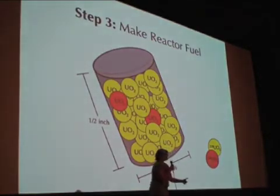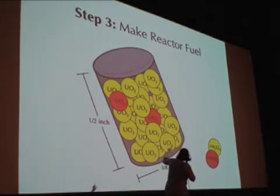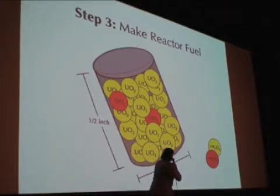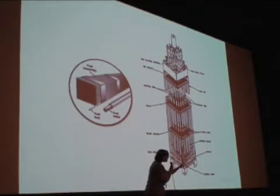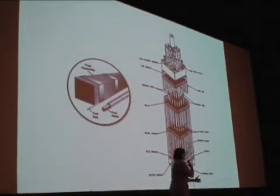But once you have your enriched uranium, you can make it into uranium dioxide and shape it into a little fuel pellet — about 7 grams in weight. It's a little ceramic pellet made in a kiln. Then you line them up in a long zirconium rod, get a whole bunch of these, and line up all these rods into a giant square stack. Now we have the fuel for a nuclear reactor.